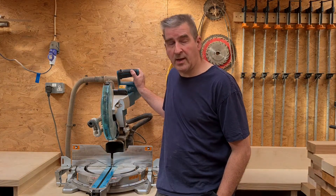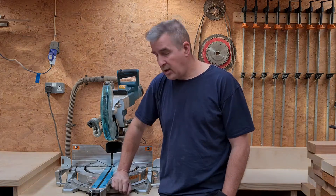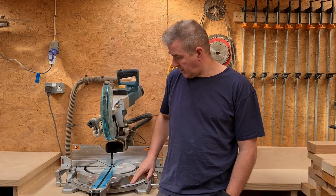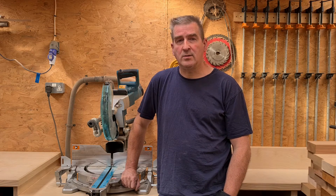You don't need to buy a high-end one like this Makita behind me. If you happen to have the funds, great, knock yourself out. But you can buy a cheaper one as long as it's accurate. Even straight out of the box, chances are it won't be — even this wasn't accurate straight out of the box. Read the manual, do a couple of screws generally, a few taps with your hand with a set square, and you can set it up to 90 degrees within two or three minutes without too much fuss. A cheaper one is definitely the way to go.